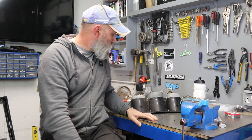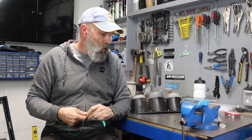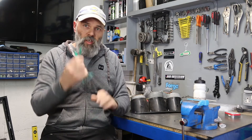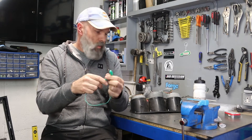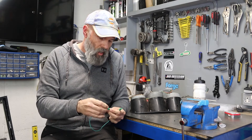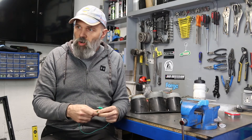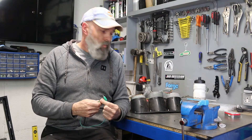The base goes through the resistor — which isn't directional, so just put it in any way — and that takes the signal through to the ECU signal cable. The final pin, the emitter, goes off to ground. What I like to do to make sure it all works is, before stripping things down and building something permanent, just get a bunch of crocodile clips and wire everything up in sequence. We'll run through that now, try it on the car to make sure it works, and then come back to make it more compact.